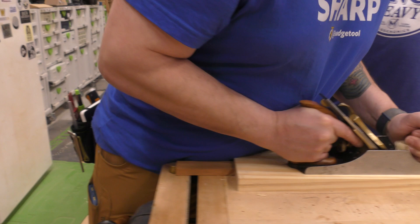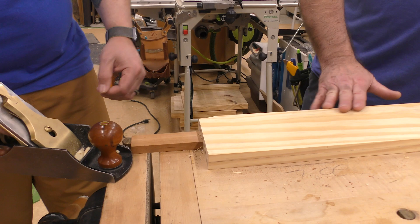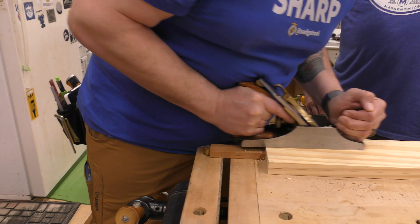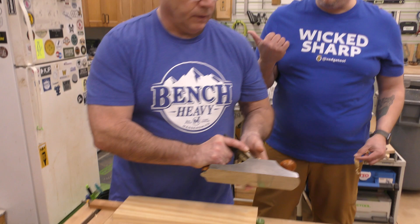You're going all the way through — you're learning. Big D, start the blade forward. You can see it: you're starting here and getting a divot. You'll want to get to the point where you're picking the plane up and bringing it back like this — because it's not cutting on the way back. It only cuts on the way forward.